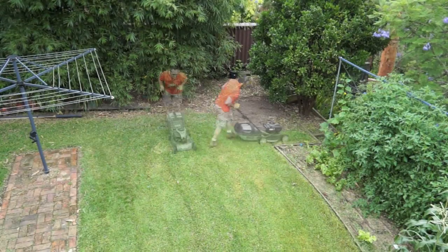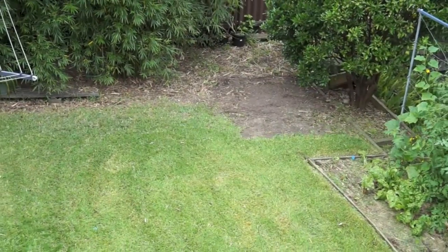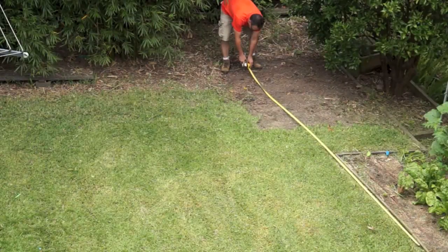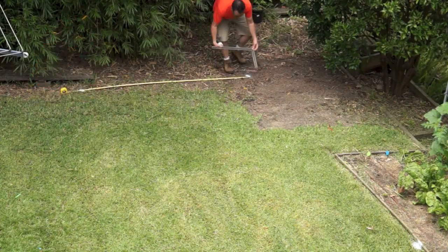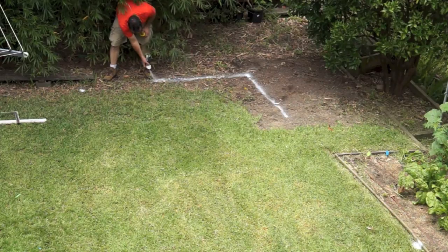This corner of the yard doesn't get used for much more than mowing. It catches a good range of sun and it's protected from the worst wind, so it's a perfect spot for a greenhouse. First off, you need a floor. If you've a level area, you might just lay a gravel bed, but we have a bit of a slope, so I'm going to make a jetty style floor using sleepers. The floor is simple to lay, but first it has to be marked out.